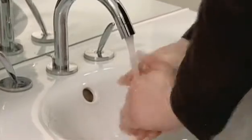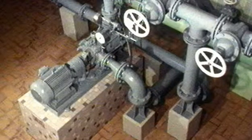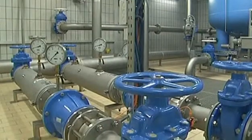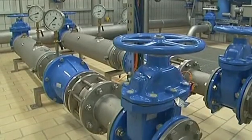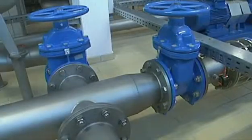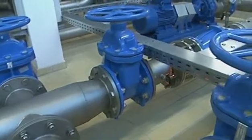Centrifugal pumps require a compact and solid foundation, and it's difficult to install them at the pipe system. Compared with them, our pressure shroud pumps are installed on light pedestals or on simple steel feet. This makes the tile work, for example, considerably easier. In case of horizontal installation, the pump can be directly installed in the pipework, so the pipework becomes simple and cost-efficient.